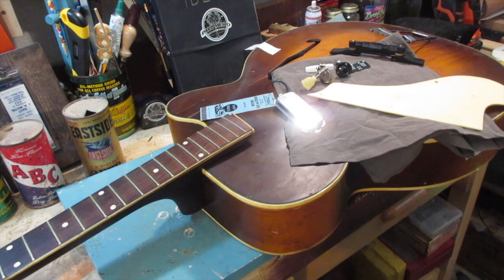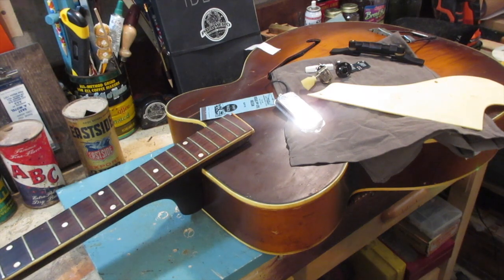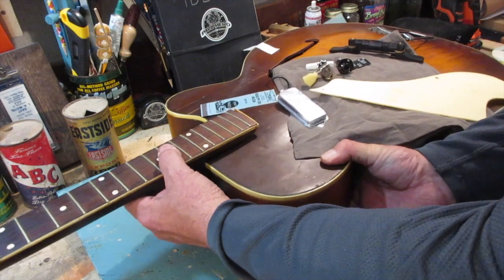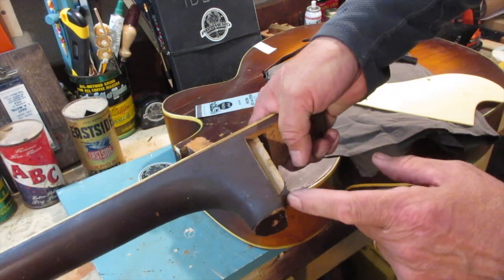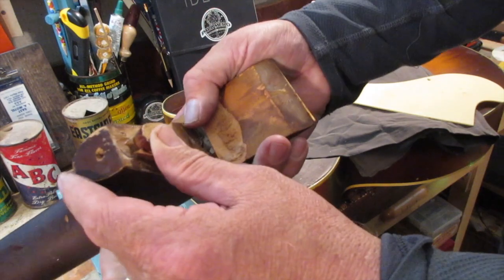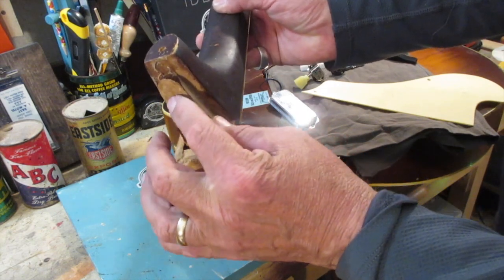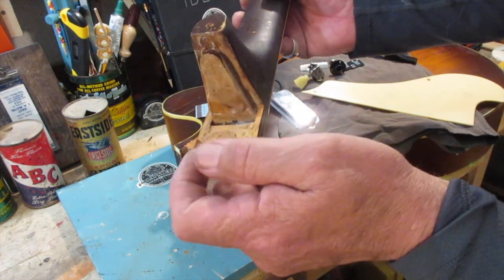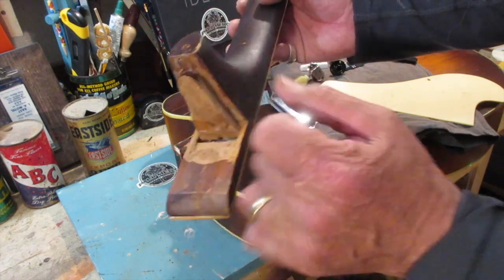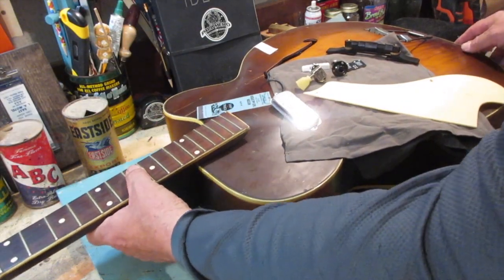I'll break out a separate video on how this neck goes back together. I'm going to bolt the neck - I did an episode called 'Bolting On a Junky Arch Top Neck' and I'll give you a link. One key thing: if you run a bolt down in the lower area you would miss the wood entirely, and even up here this isn't very wide - if you're off at all you would break it out and ruin the guitar. So the bolt has to go way up in here, and it will land right here. The smart thing is to do that while the neck is off the guitar, drill your pilot holes, and figure out where you're at. We'll have a look at that in a separate video.